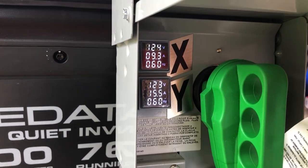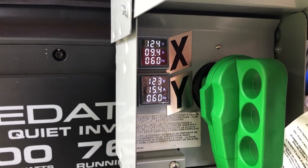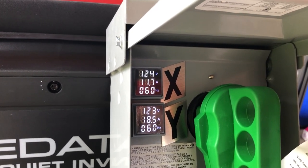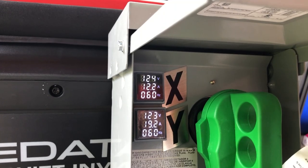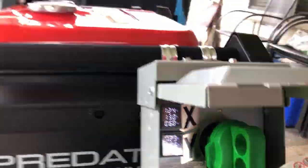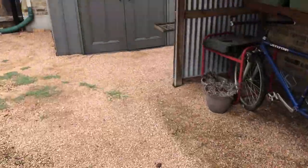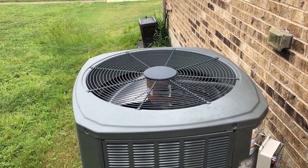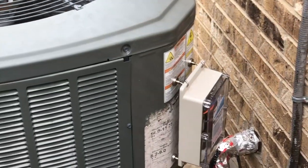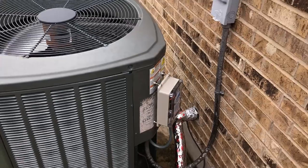Here's where we're turning on the AC unit. You'll see that first surge — the 9.3 jumped up and spiked to 18. That was the AC unit kicking in, then I went around to check the condenser. Now I did cheat — I have a soft start unit on the AC, which allows the compressor to start without needing 80 or 100 amps. You've got to have that if you have a large AC unit.